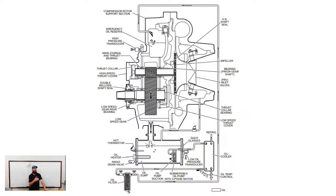For example, you could run a York condenser water set point down to 60 degrees on the most recent revisions of the YK series chillers. You can't do that with a Trane. Trane needs that extra condenser water temperature in order to maintain proper oil return. With the way that York has designed their machine, which plays more into the oil design, but how the compressor runs plays a part in that, York's version of it allows them to achieve that.